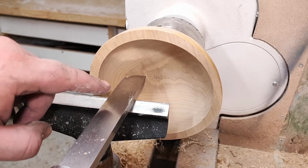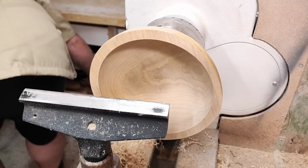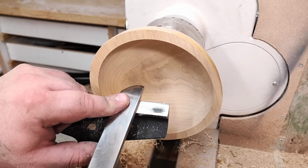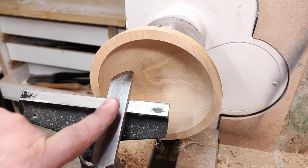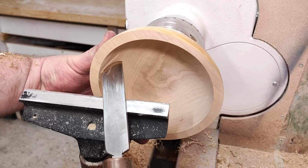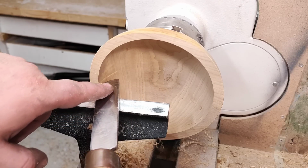Cutting tools are slightly different, but with the scrapers, skew. So if negative rake scraper, something like this. I always have one for demo purposes like this. So you can have a big catch with this tool as well. So you just have to drop the handle way down, so the top bevel here is now pointing up into grain. So again, here we are okay, but once the grain aligns at this stage here, it wants to break out. So just be aware how you position on a cross grain work like this. You always have to be aware of that negative 90 degrees.